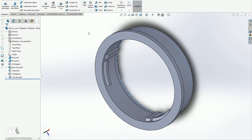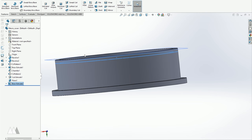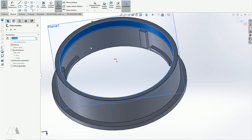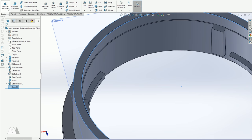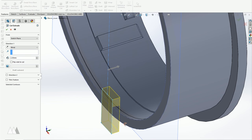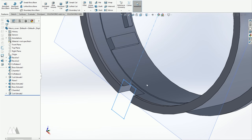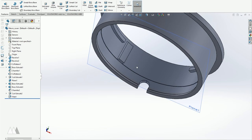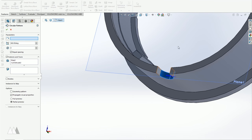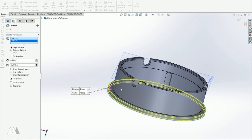I'll extrude this top edge a little higher to match the height of my glass filter, and then I'm going to create another ring on top of that that's exactly the size of the glass filter, so when I pop it in, it holds itself in place. And then I'm going to create these little notches, and I'll do three of those around the rim of this part, that way the ring can expand just enough to let that glass filter slide in and then close around it and hold it in place. I'll finish up by putting chamfers on all these corners just to make everything less sharp.